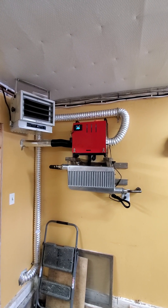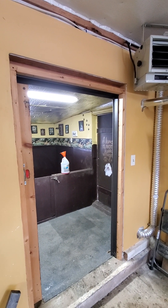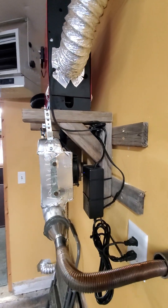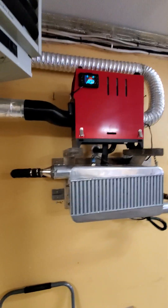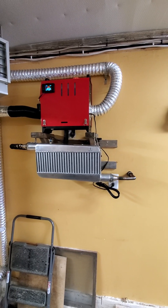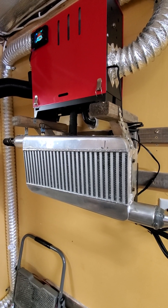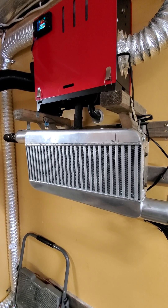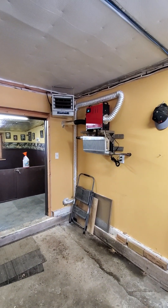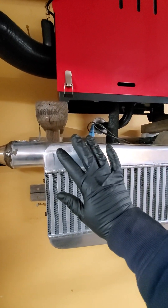I needed the nursery warm, so this is what I'm using. For a gallon of diesel it burns two or three days' worth of nice warm temperatures in there. Anyway guys, hope that works out and gives you some ideas. If you have any questions feel free to leave them in the comments. I'm not an engineer — this is just my rendition of what I've seen. I know a lot of people have used cast iron radiators for the heat exchanger, but I thought a nice lightweight aluminum intercooler would be best because that's in essence what it is — it's a heat exchanger. Hope this helps, hope you like it, give it a thumbs up. There go my cooling fans — I know you can't see the warmth but my hand can certainly feel it.